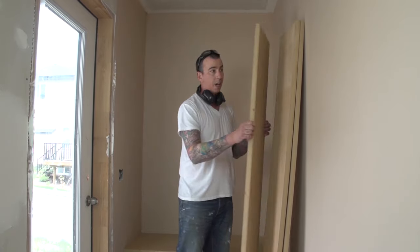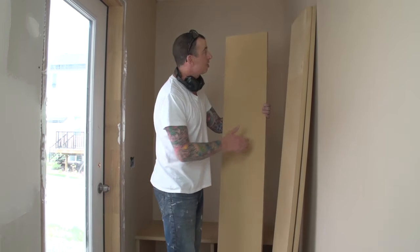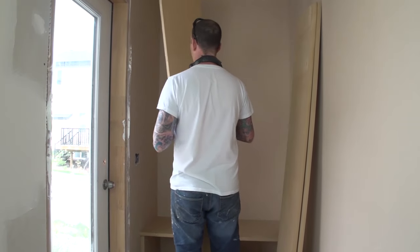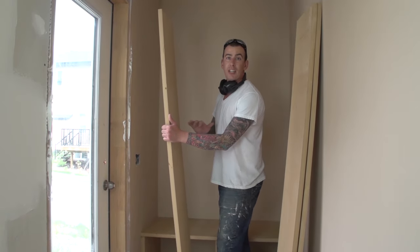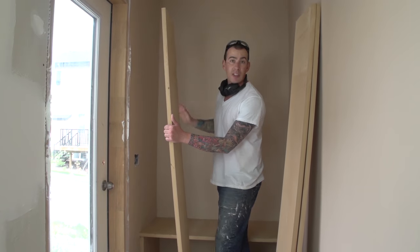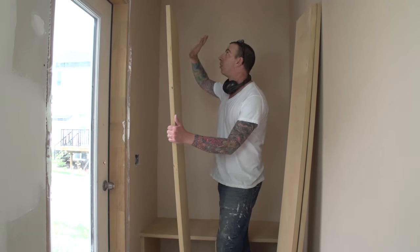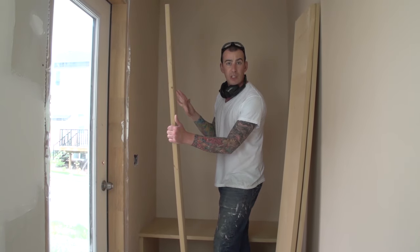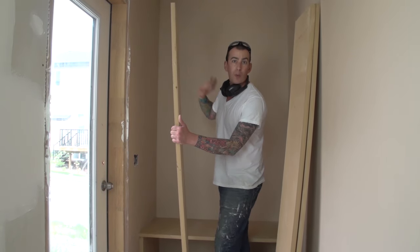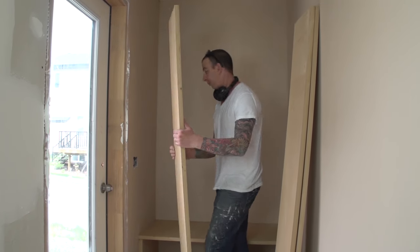Okay, so here's my three gable side pieces. Just gonna fit them in to see that I've correctly left the gap at the ceiling to fit the last top wood piece in. Then I'll bring the wood top piece in, slam the two side pieces into position, which will then hold the one up at the ceiling until I can get the nails all in.